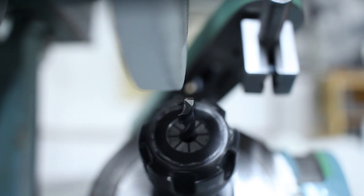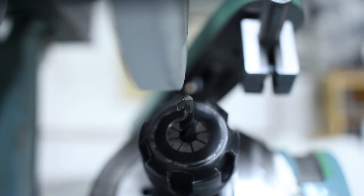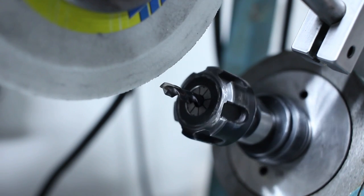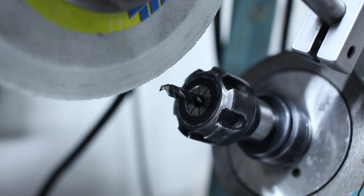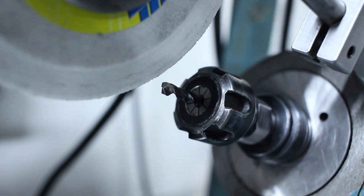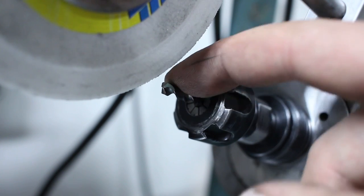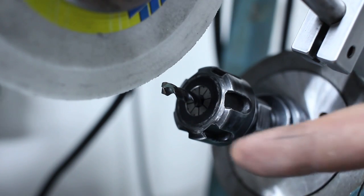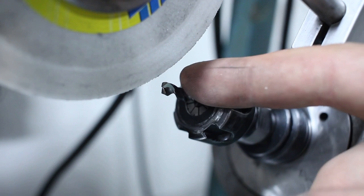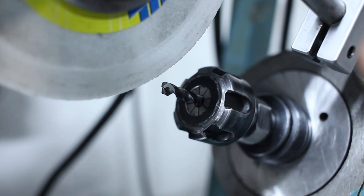I think in the future I'm definitely going with this style of grind if I have to regrind a drill. Of course, from a viability standpoint, it's questionable, but a good carbide drill costs 20, 30, 50 bucks. Even a good parabolic flute drill like this, high-speed steel, costs 5 to 15 bucks. All in euros, of course. So, batching them up and regrinding them really can pay off.